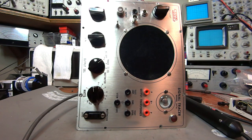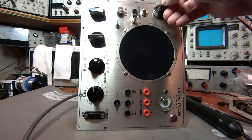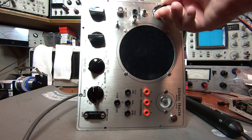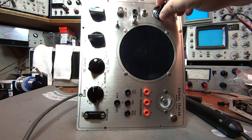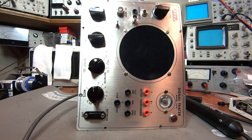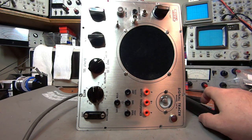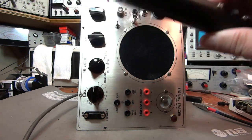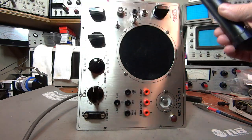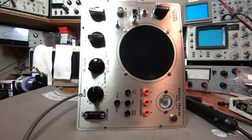To do that, this thing has to have a 5-volt power supply added, and that 5-volt power supply is adjustable with this gain knob. You can add more voltage or less voltage, and what that does is it increases the already high gain of the probe itself. There's a circuit inside of here that has several BJT transistors running at extremely high gain, and so that probe works very well for sniffing out circuits.